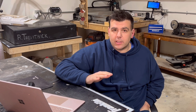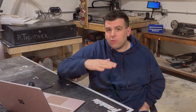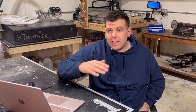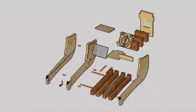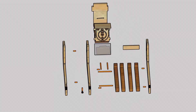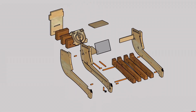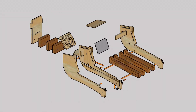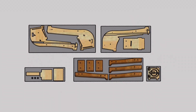If you've watched my channel in the past, you know that I use my CNC machine to make most of my projects, and because of that I'm limited in what I can carve out. My machine can't carve sideways — it can only go up and down and left and right — so all of my components need to be flat-packed when they're carved and then assembled later on. Here's an exploded view of all the components for this project and you can see how they fit together. The orange things are quarter-inch dowels that will be placeholders to line everything up once everything is carved. Some parts are glued together aligning with the dowels, and others are screwed together, but in the end everything can be laid out flat and put on the machine to be carved.